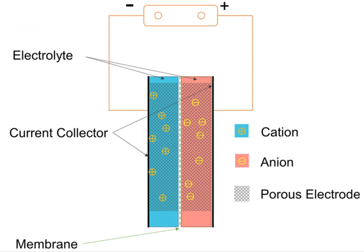In some literature, the terms anode and cathode are used in place of negative electrode and positive electrode. Using anode and cathode to describe the electrodes in supercapacitors and also rechargeable batteries including lithium-ion batteries can lead to confusion, because the polarity changes depending on whether a component is considered as a generator or as a consumer of current. In electrochemistry, cathode and anode are related to reduction and oxidation reactions, respectively. However, in supercapacitors based on electric double-layer capacitance, there are no oxidation and/or reduction reactions on either of the two electrodes. Therefore, the concepts of cathode and anode do not apply.